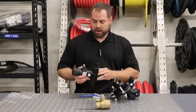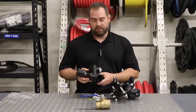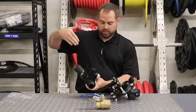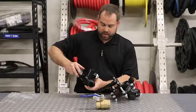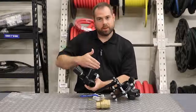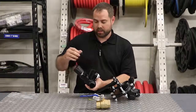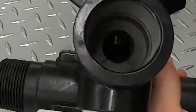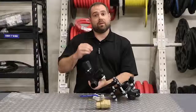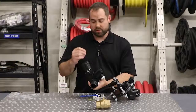This is our FINA II valve. We also have a FINA I — this is a plunger style valve. You've got your opening there and a plunger that moves in and out. As you twist it, you come up and down to allow less or more abrasive into your blast mix. The bonus with this is each little turn is just a little bit more, and you can do a very fine-tune mix of abrasive and air ratio as you're going through.